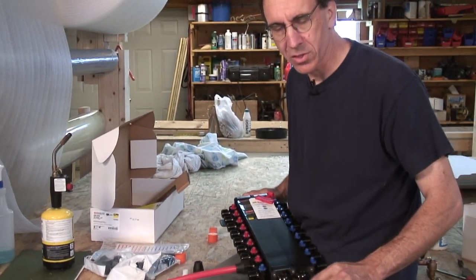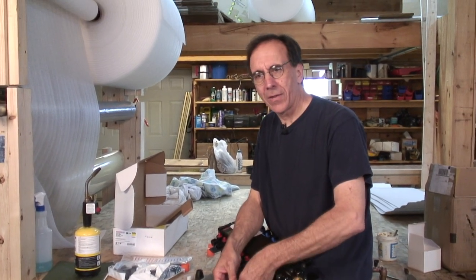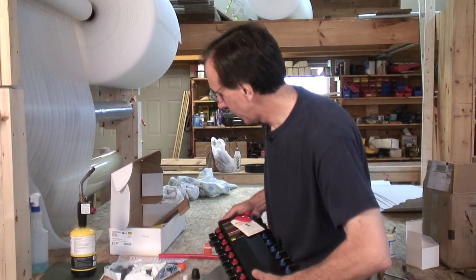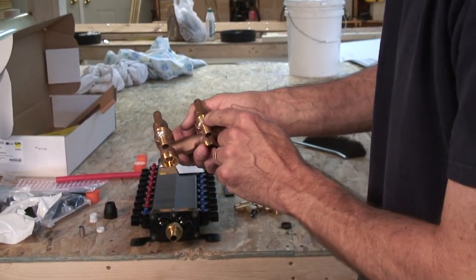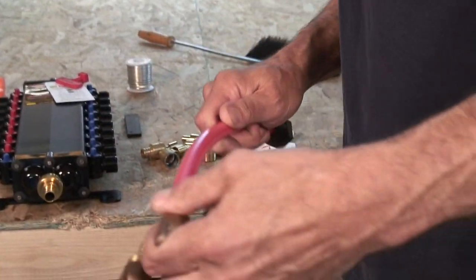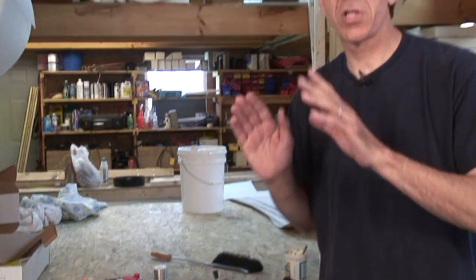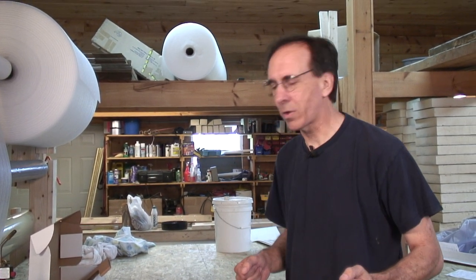We will be doing some crimp connections to tie on, so we are going to need some tools, but I'm going to take this off for now. The hookup, we're going to tie in the cold water. We're going to transition over to the water heater, and our first hookup will be a washer dryer valve, which I have already set up here. We did do some soldering here. I put two crimp connectors that the PEX tubing would fit onto like so, and I don't have any crimp rings right here with me, but you'll see that in a few minutes, how the crimp connector goes on there, a little bit different. We'll hook that up in a little while. Right now though, let's go situate the manifold where it's going to go, and we'll get it set up, and we won't have the water shut off for too long either.